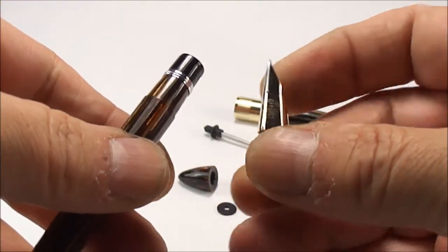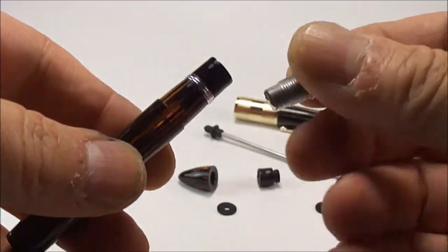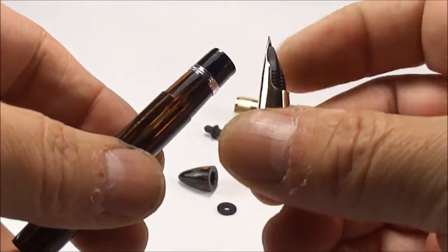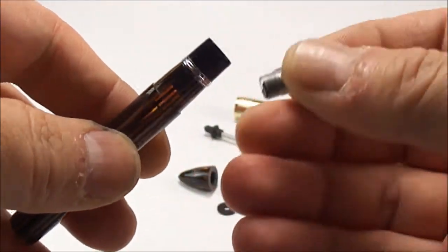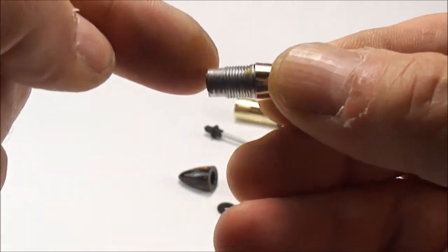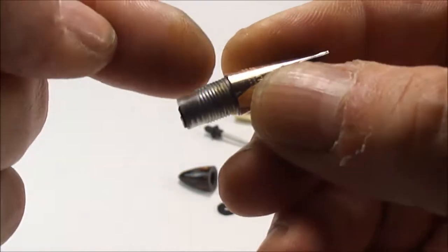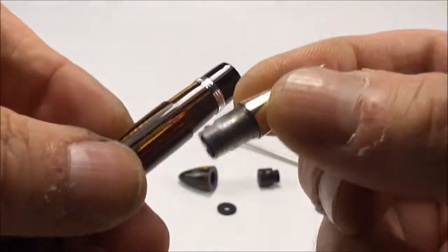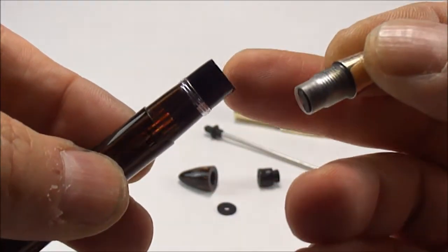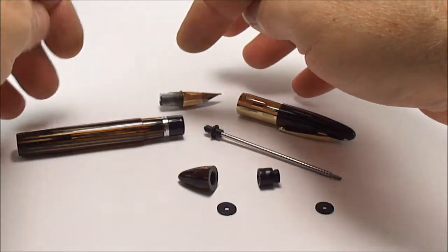You've got to be very, very careful because if you try and unscrew it or if you don't do it right, this particular plastic section will break off. In my case, I soaked it overnight in a solution of water and ammonia. When we eventually unscrewed the nib section, we had the remnants of what looked like a rosin-based sealant on the thread. You've got to keep soaking, apply heat, soak again — in my case, a solution of water and ammonia.